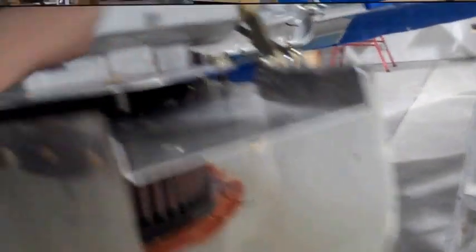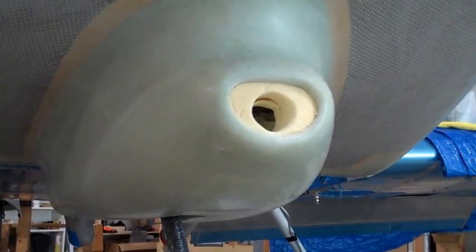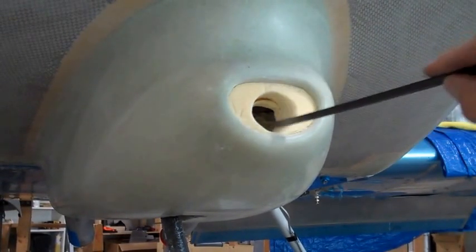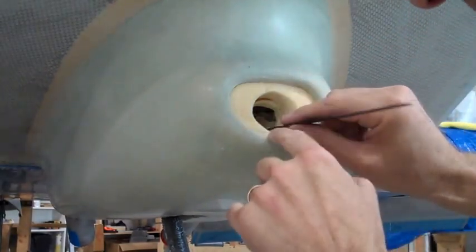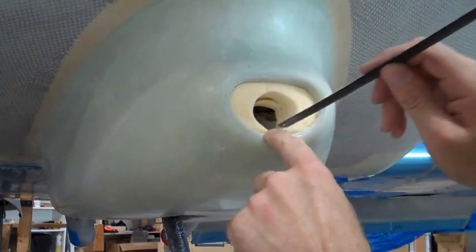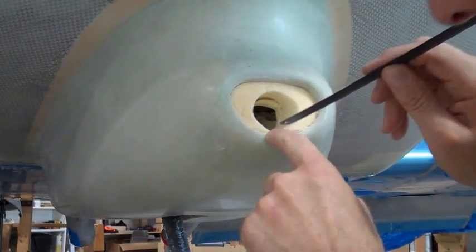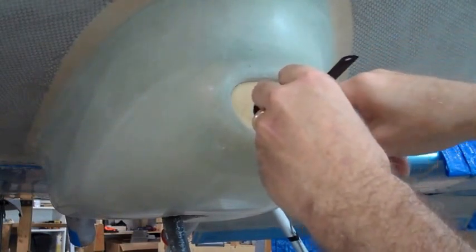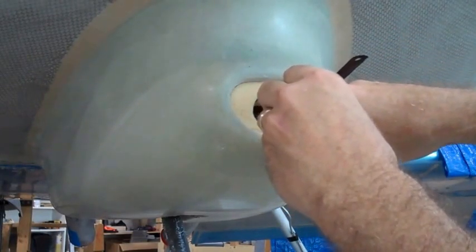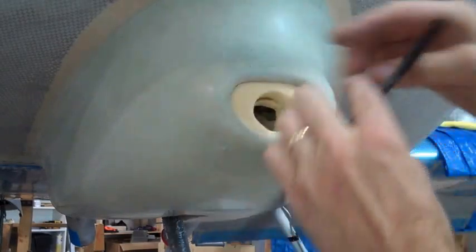The only thing we want to do here is remove this, take it off, take out the filter, and block off the opening and put the casing back on. Then I'm going to take a hacksaw blade and start cutting and shaping, keeping it flush with the snout and lining it up with the filtered air box, so that you're getting a nice transition.